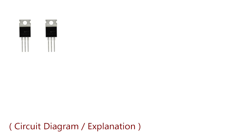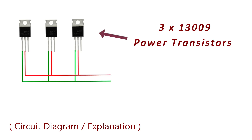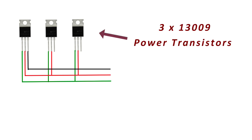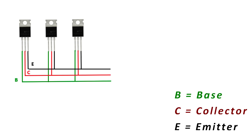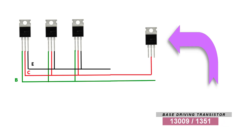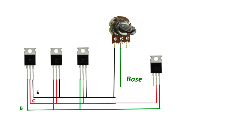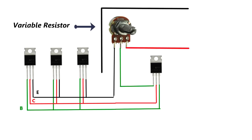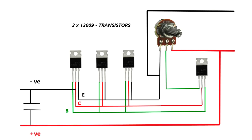As you can see in this video, I'm doing the step-by-step transistor connection. Three transistors are being used - each MJE13009 - and all three are going to be connected in parallel, meaning base to base, collector to collector, and emitter to emitter. After that, another transistor is used to drive the base of the original three transistors. Then to the base and collector of the driving transistor I have connected the variable resistor. The output is variable from zero volts to 120 volts DC.